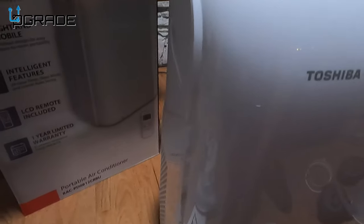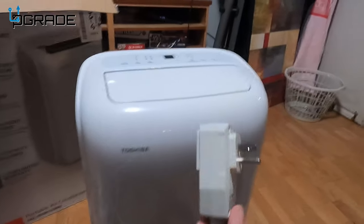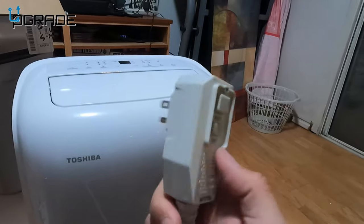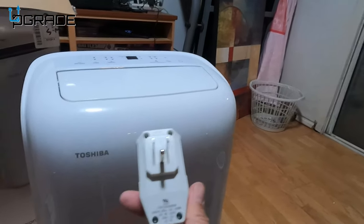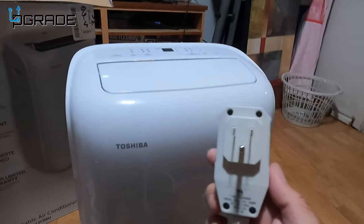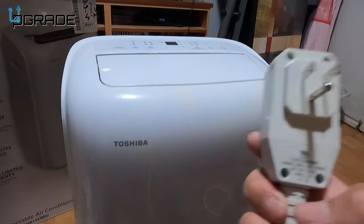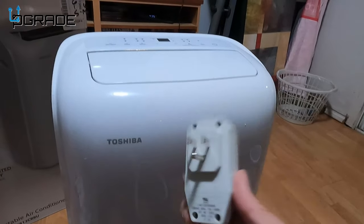It's a high-voltage system, so it's going to cost you on your monthly bill — when you see a plug this big, you know it's going to cost you. There's a reset button and a power button on the unit. Inside there's also a fuse. People throw these units away not knowing you can replace the fuse when you get a short circuit — you can unlock it right here, there are four screws and a fuse in there.